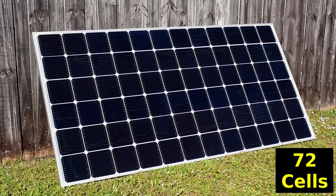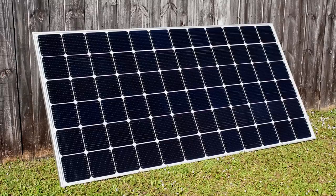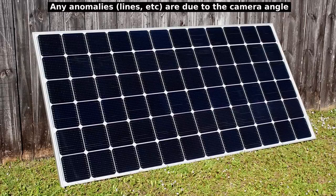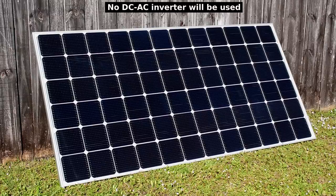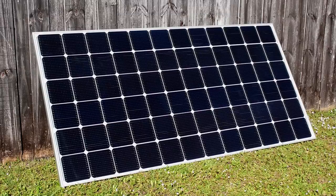What I want to do in this video is test the power output. I'll use my Max Oak power station — it has an MPPT charge controller. We're going to measure light intensity on the panel, and then I want to see what kind of 120 volt loads, tools and small appliances, we can power directly off that panel using a DC to DC step-up converter, or boost converter.